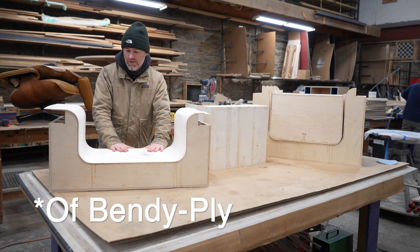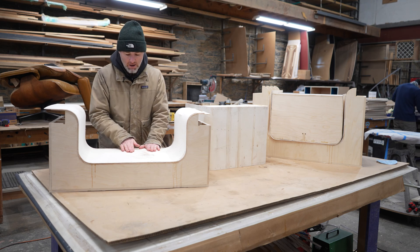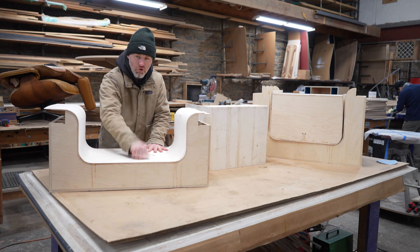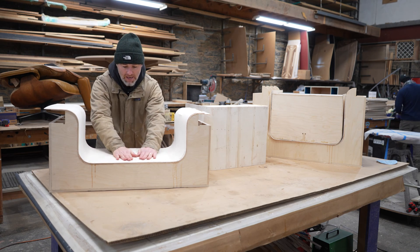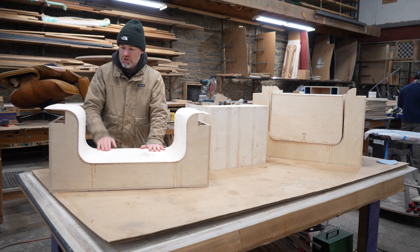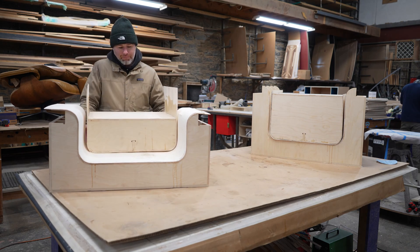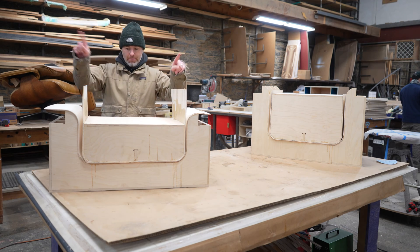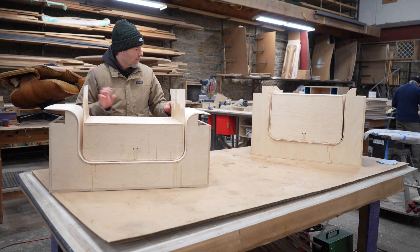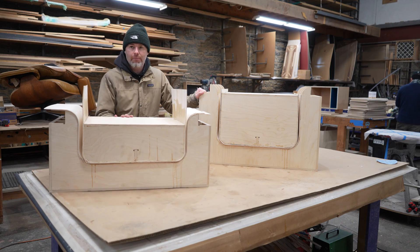The reason I do two layers is we have four ribs in here and if I just do one layer I'd probably get some indentations in the mold. By doing two layers it's rock-solid and I know I'm going to get even pressure on the mold. Before I do the first lamination I've got to sand off some of these cracks. This piece is going to slot right in here, then we'll get the first U-shaped piece in. I just have to trim this excess material, then sand and clean these up a little bit and make the first prototype.